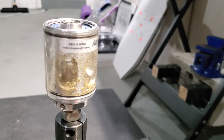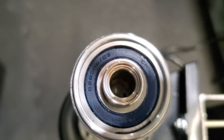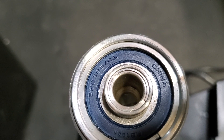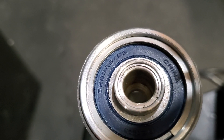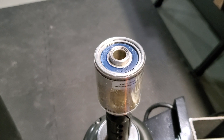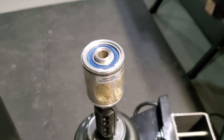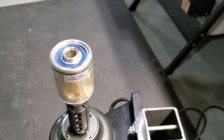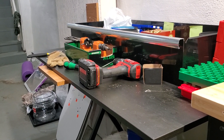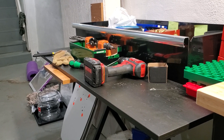The way it works, there's a carbide bit in there — if you look down inside you can see it's shaped roughly like your cartridge. It indexes off of the shoulder, so all you have to do is push it in, give it a quick twist, pull it out, and you are done trimming, chamfering, and deburring. It's a huge improvement over my old setup right over there — the Lyman Universal. It works great but it's kind of slow.